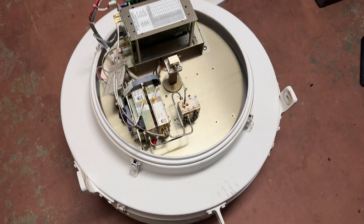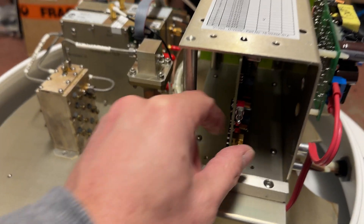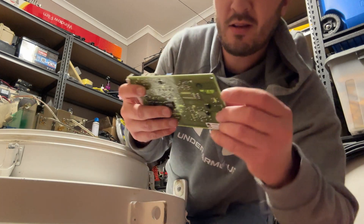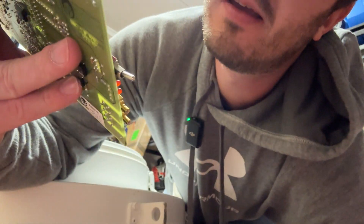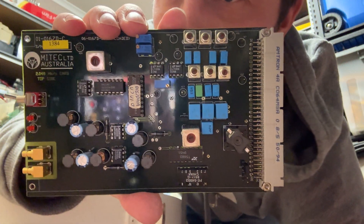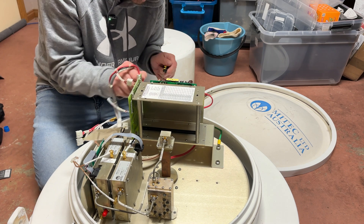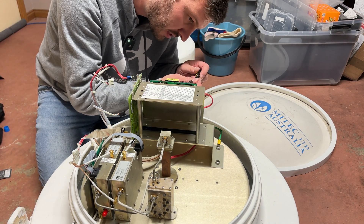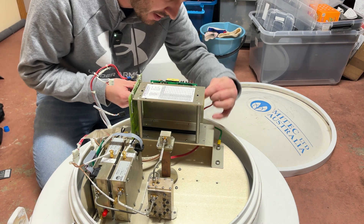The dish size is 600mm, so it's quite a big dish and should have a fair bit of gain. What's this card in here? It's got 1995 written on it — it's a 2.048 megabits per second card. I'm not sure if there's anything I can reuse on that. If you can search around and find ex-commercial links like this, a lot of the time they might be on frequencies that we can't use as amateurs, but ones like these do come up every so often and you can make use of them again.